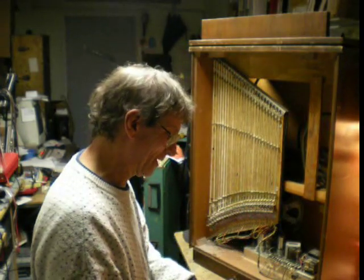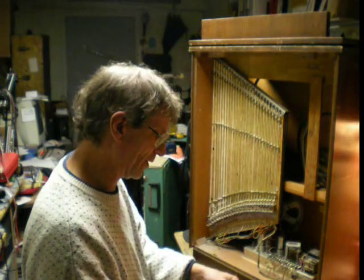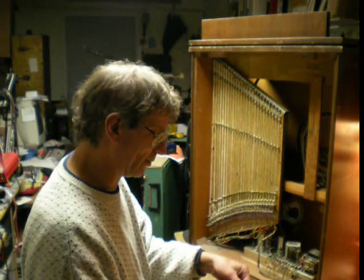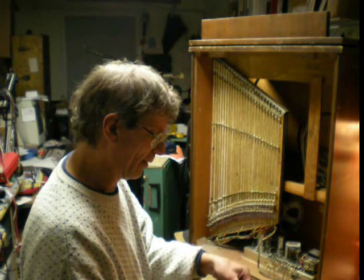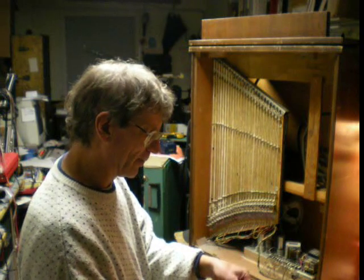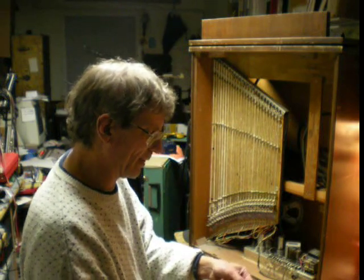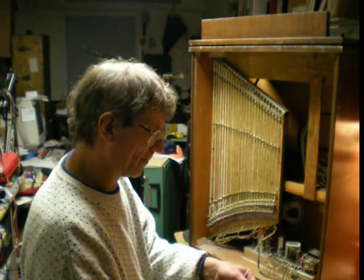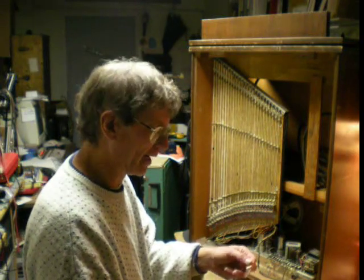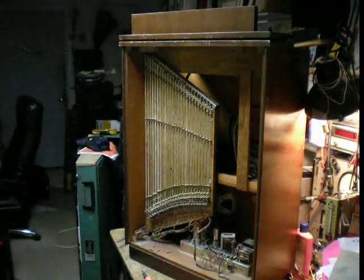Anyway, I've got a nice little piece of tough plastic there now that I can layer on there with E6000 or Goop Automotive, and that way it sticks out a little bit so you'll see it, and it won't be a big cosmetic blemish. That way I can cut it probably right there so it won't stick out to where you actually hit it. So that's one way to repair a key like this, I believe. I can super glue the interface and then layer the thing with the Goop adhesive and this thing under it, sandwich just a little layer, because that stuff dries like rubber bands, so it won't add much tension to the key.